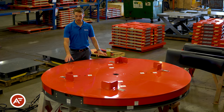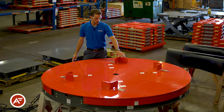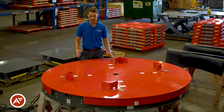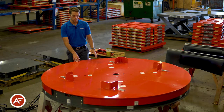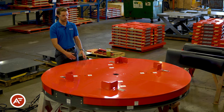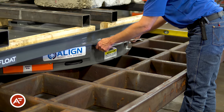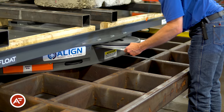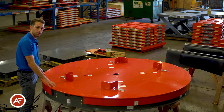As you can see, we now have the top on this table. This table features a custom set of corner angle locators as well as some machined pads for the customer rack to sit on top. This table is rated for 12,000 pounds, but again we have standards that go up to 16,000 pounds and customs that go much larger. If we go around to the side, you'll see a space for the slide-out internal components, so all of these can be slid out and serviced and replaced without having to take this top off.